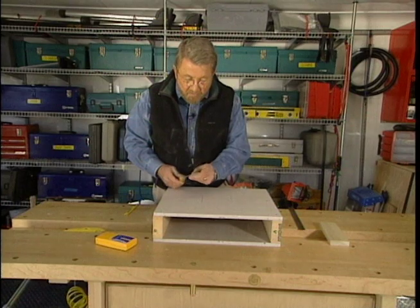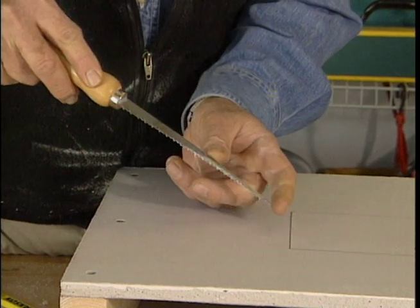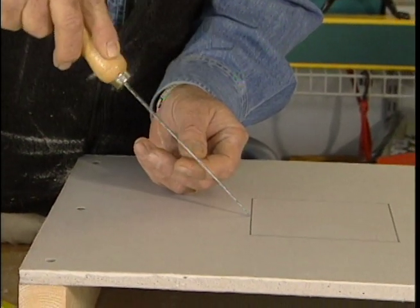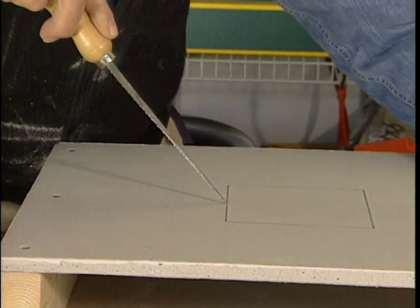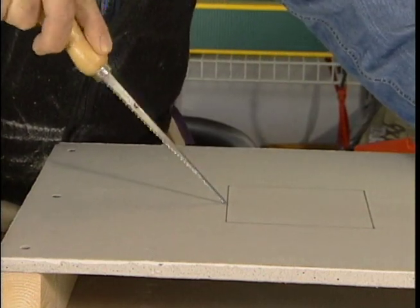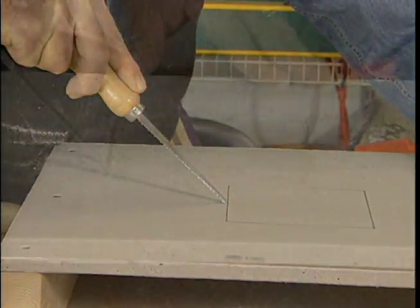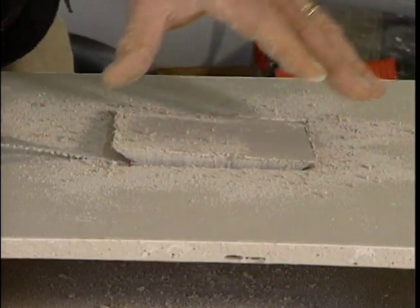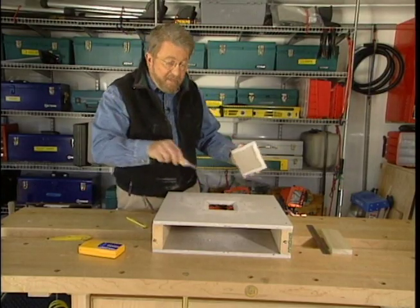It's got a very sharp point on the end, so the saw acts kind of as a drill as well as a saw. Place the sharp tip of the saw on the line, and then angle the saw at about 45 degrees. Push the saw and wiggle it back and forth until it penetrates through the wall board. The angle cut prevents the cutout from falling inside the wall.